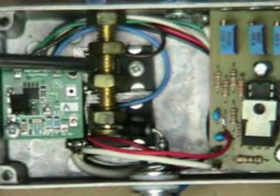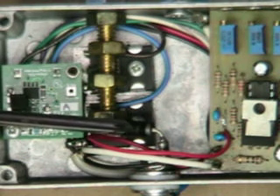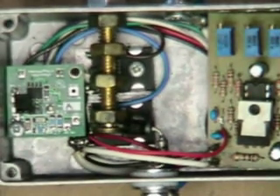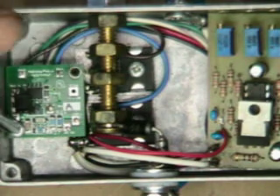This brass bolt, where it goes onto the MOSFET — the MOSFET has a long tang that comes up. I've drilled holes in this for them to go up into here and here. This also fits down in the hole. My diode you can't see because this thing doesn't want to focus very good. When I tighten these nuts up on each of those, it will make a good connection.